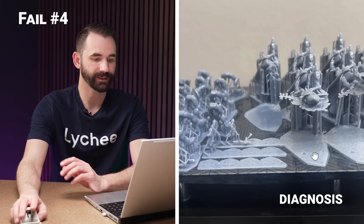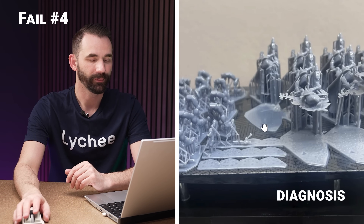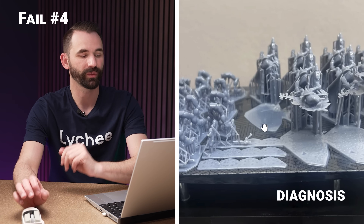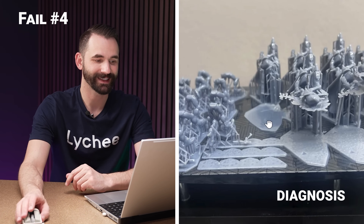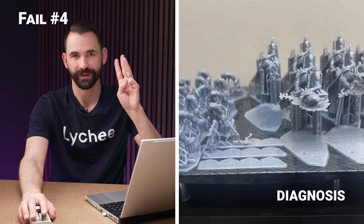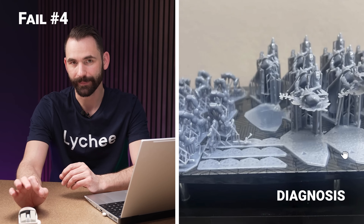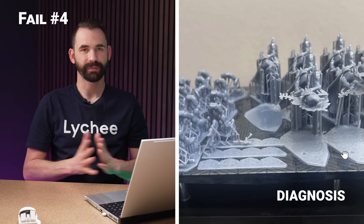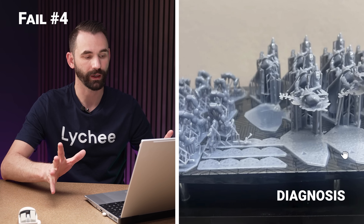Here's another one where it really pays to pay close attention and have that magic eye. This is a Saturn 4 Ultra. There are two other really important things we can see. The first is that in the center, the raft is polished and thin. On the left side, the rafts are thin and everything printed. On the right side, the rafts are thick and bumpy. What does that all mean, especially on this particular printer? That kind of tells me the entire story of what's going on here.